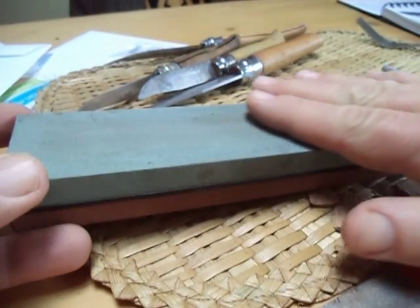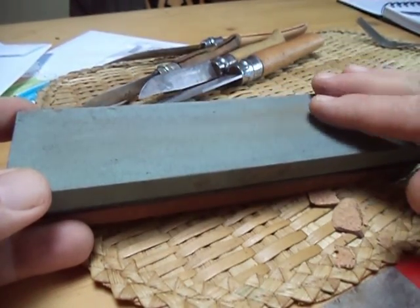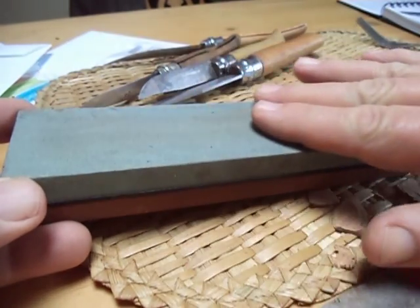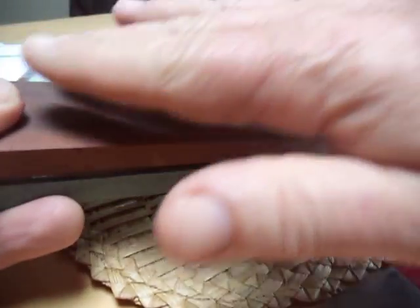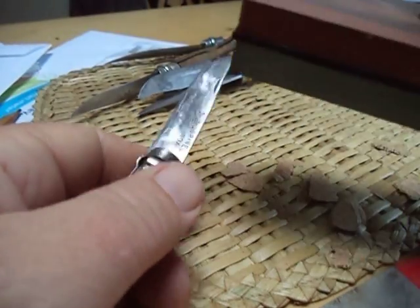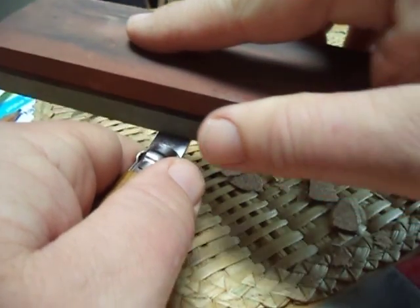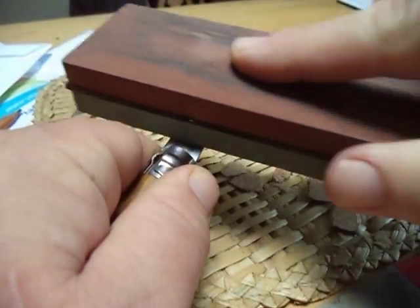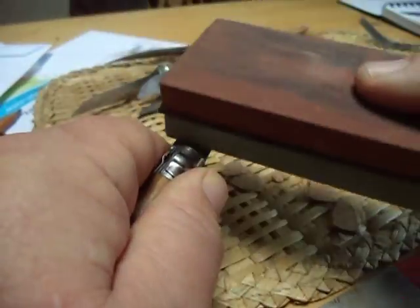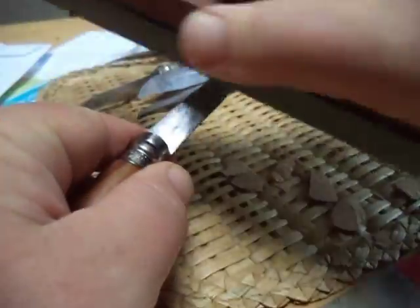And they do these water stones. Now you should soak these in water before using them, and they work much more effectively when you do that. I've actually just sharpened these knives. This is the rough side, and this is the smooth side. So when sharpening one, depending how blunt it is, one will begin with a number of strokes on the rough side. You can feel that it sounds rough, can't you? And you don't want to overdo it with this, because you'll end up filing away too much metal.